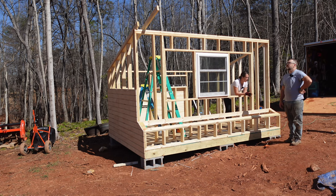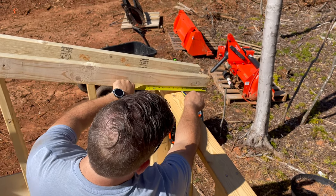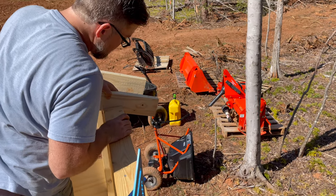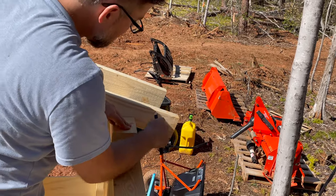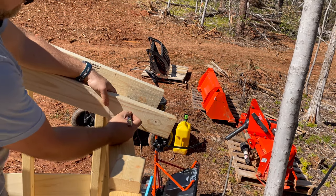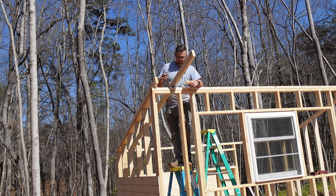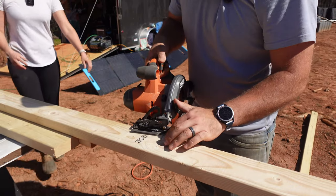All right, you wanna chop it? Batteries are charged for your saw? Hopefully. So we can see, well, 6-inch overhang, which we'll put here. That's our heel. So if that's at a 90-degree angle, come up to our 6-inch mark. It's pretty close. I think if we just chop that out, that could work. So I'm gonna mark my piece of wood here, and then show you in the cutout table what we got. All right, let me know when you're ready. Ready.